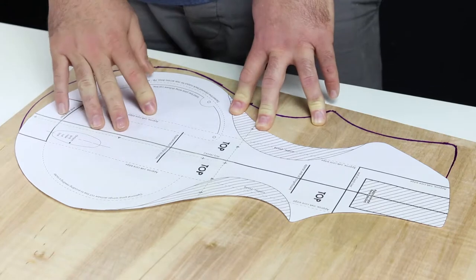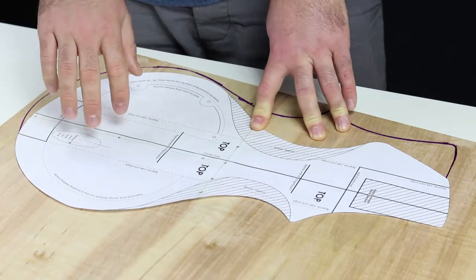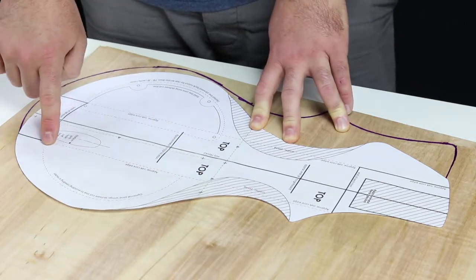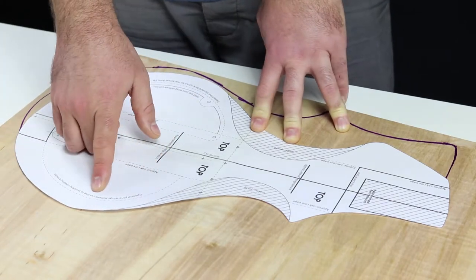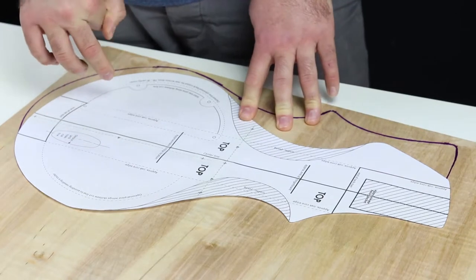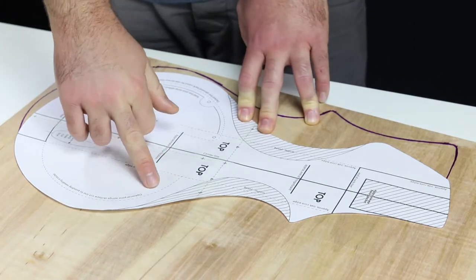And technically you don't need for the... Well, you do need for this if you're going to do the bevels. Though I guess you could technically jigsaw out those bevels at an angle, but it would be difficult to get that to look right. Though technically it could work. But you see these dotted lines here on the opposite side from the access door. It says optional pine wings skill saw cut line to avoid needing a router. So for this build, I am going to be using a router and assuming that you have one, but then I will show you in the F-style build how to do it without the router.